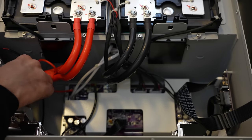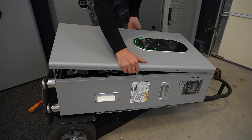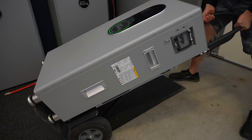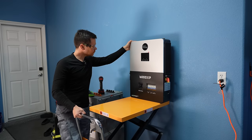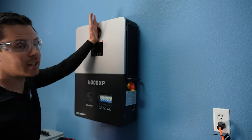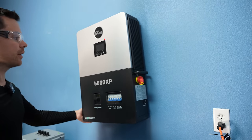The connection seems secure and everything looks pretty good — this seems like a solid battery. We have to put the lid on very carefully; you do not want to drop it. For wall mounting, there are three holes on the top and three on the bottom. Hit a stud with the center hole, then mark and use drywall anchors for the side holes.